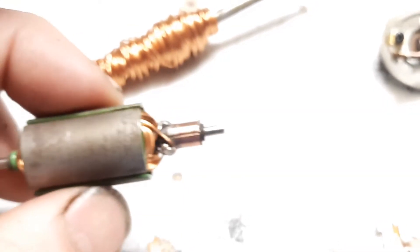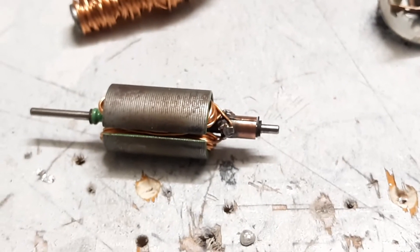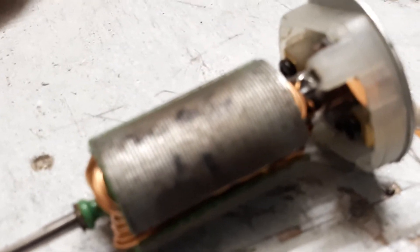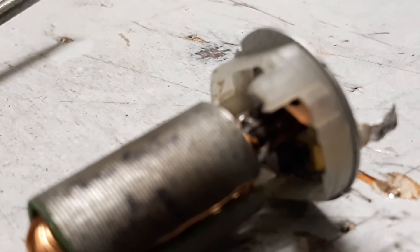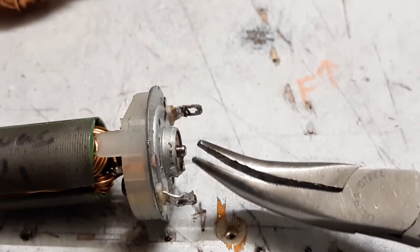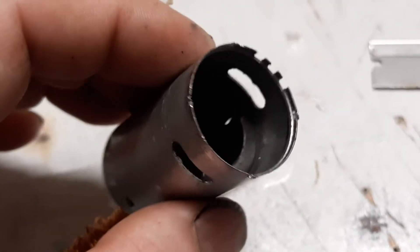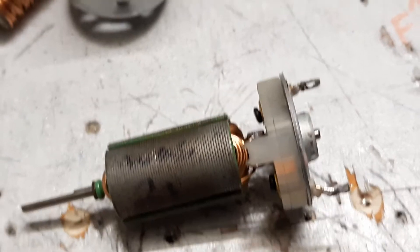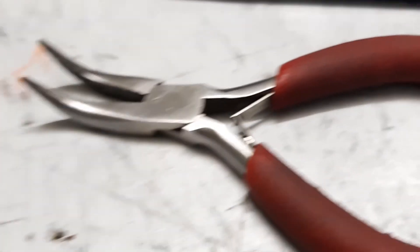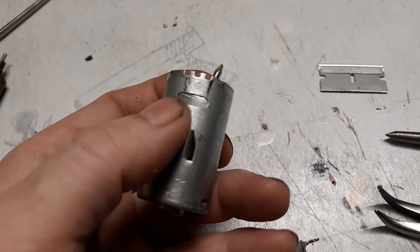When you're putting it back together, you can take it apart, clean it up, resolder it, and put it back together in a reverse process. You'll probably want to use something like a small bladed screwdriver to get the brushes over the armature correctly. Then you're going to use jewelry pliers or a pair of side cutters, grab the shaft real tightly, and load it down in. The magnets are fairly strong in this particular motor, so it's going to probably pull it one direction or the other — if you lose it, just pull it back out and start over. Drop it down in there until you get a nice feed, then put it back in alignment with your alignment marks.